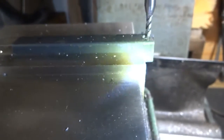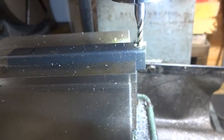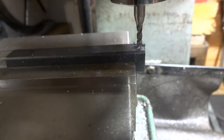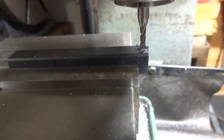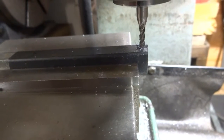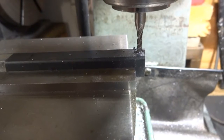Here's the first pass with a 1/8-inch end mill. We went straight across and intersected with that little hole — you can see it better on screen. We went straight across until we intersected with the hole. We're only 60 thou deep and we need to be at least 107, so I'm going to back up and take another cut at that 107 depth.